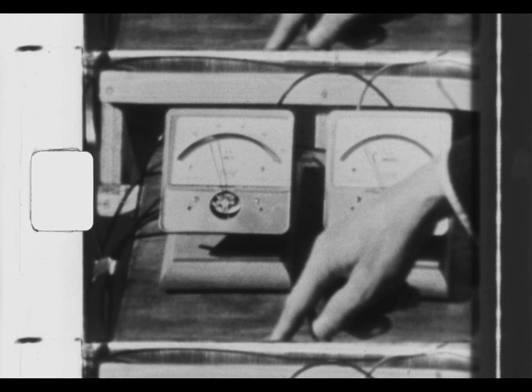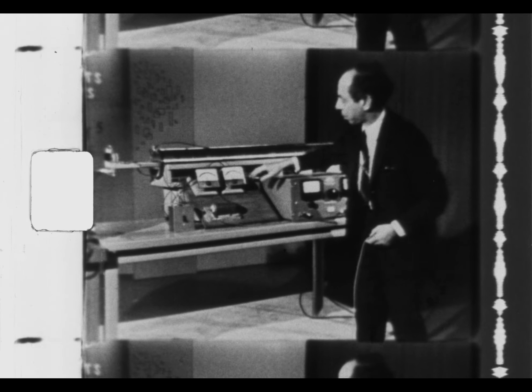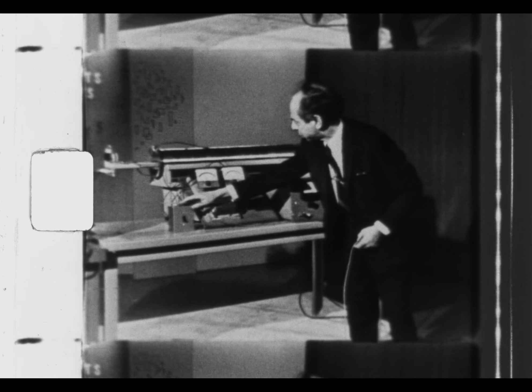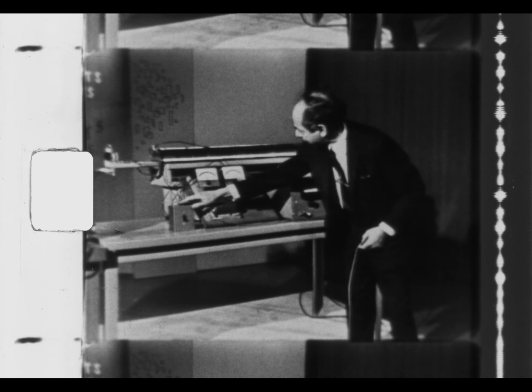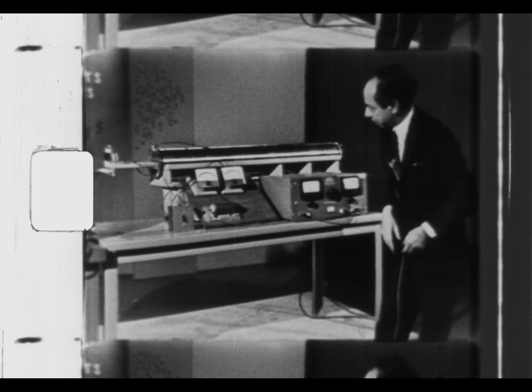If you want to keep it at a constant voltage, you'll have to check it every once in a while. This is a regulated power supply and it will keep the voltage quite constant. Current goes through this limiting resistor, goes through the ammeter, but the ammeter has a shunt across it because when we short out the wires, the current will go way up. To read it, you have to push this button which removes the shunt, and we see that there's about 4.4 amperes at 15 volts with all three layers in parallel. So you can calculate the resistance of the coil.